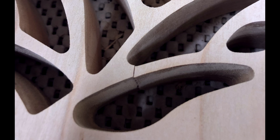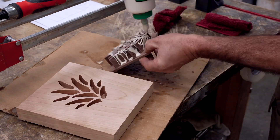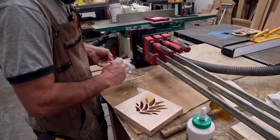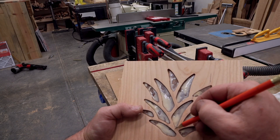I was getting a really good finish on my inlays, but had another problem: my female inlay was developing a slight crack consistently at the same spot. I asked for help on the Avid CNC Facebook group, and someone suggested adding a bottom skin to hold it all together. I went back to my model, redesigned things, and made it about a sixteenth of an inch thicker. Cutting this shape out worked great and eliminated the crack, but now my pieces no longer fit together well. The general process is to use a small brush to coat all the nooks and crannies of the male plug. For tight fits, I was trying to use clamps to squish them together, but quite a few times I would get fine cracks in the wood and had to keep adjusting parameters.